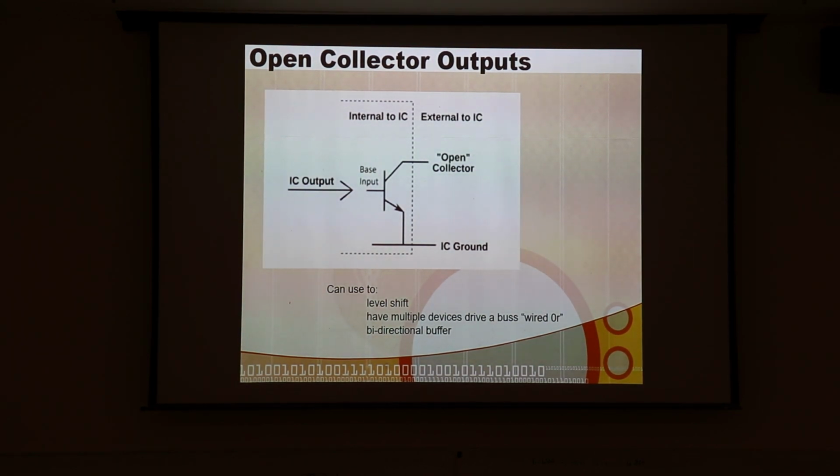As a result, no two devices ever create a short circuit where high current flows, because no device is driving it high and another device pulling it low at the same time. There are devices that are fighting each other. One's trying to let it float high with the pull-up resistors, and another device is pulling it low. Well, the one that's pulling it low will win, and the other one senses that and backs off. So that's how you can have multiple masters on the I2C protocol.